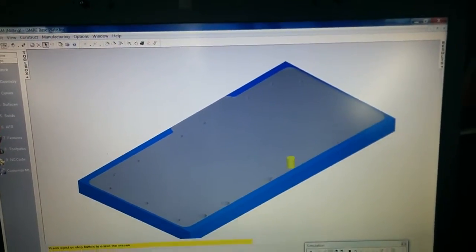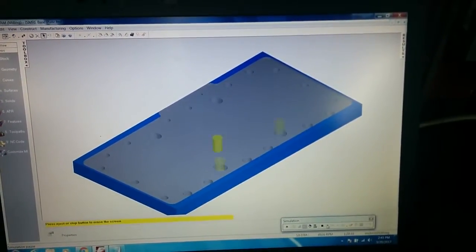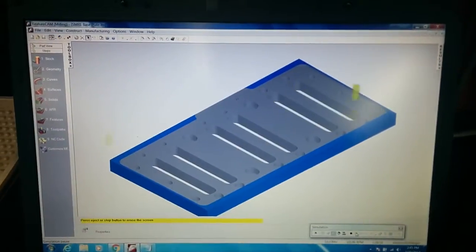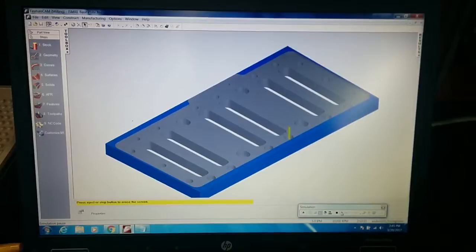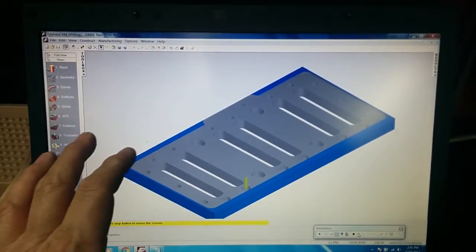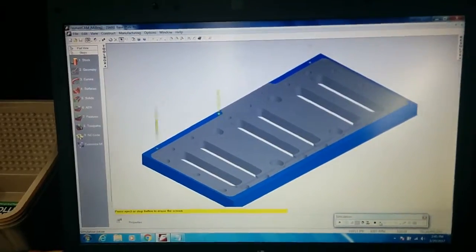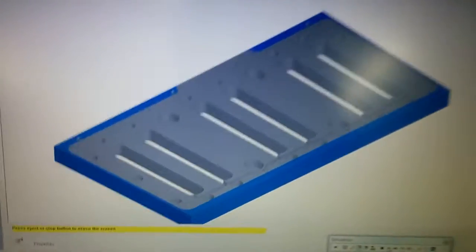And again, my little CNC machine here, this is about as big as a part. As a matter of fact, the width on this part is about 7 inches or so on the outer edge. And I have 7.2 inches of travel in my Y-axis, which still is not quite enough to do this part, because several pieces I had to actually do 3/4 of it, take it out, flip it around, re-index it, and then do the other half of the thing, just because it's so close to the outer limits of what my machine can do. So yeah, that's it.